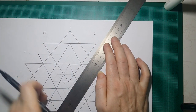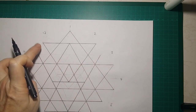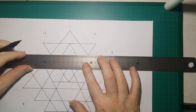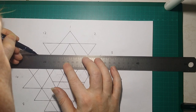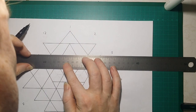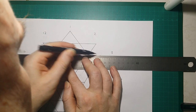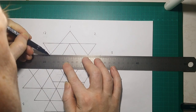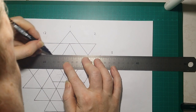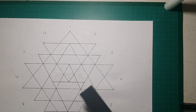Once you've drawn all the things in pencil, it's getting there. Now you've got the crossing points between number 11 and 3 and here and here for the second in the triangle. These lines you'll be able to complete — you'll now know the crossing point between there and there, because previously we didn't know how long this one was and we didn't know how long that one was. What I would suggest is you do a pencil mark, pencil mark, then measure from there to there — make absolutely sure, because this is inner to inner expanding outwards and any error will be amplified. That will result in a cascade amplification of the errors, which you won't like, as you'll have to start again.